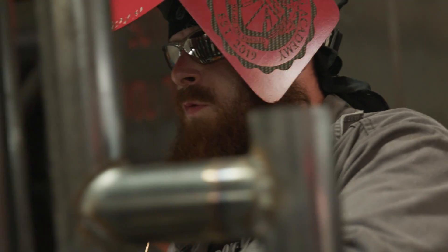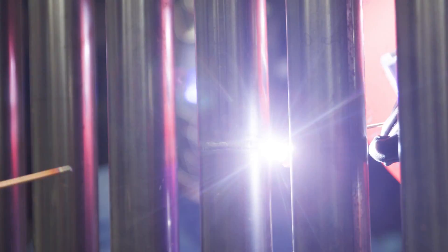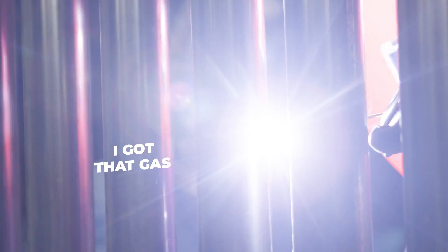My tungsten's gone — I hit an air pocket, like we were talking about at the 10-inch. Just always watch out for that. Be sure when he comes around to tie in, I've got that gas ready for him — it's helping him out too. We're not looking to put anything pretty on this type of stuff. We're in a bind, in a tight spot. We're looking to break down the wall and make quality welds. X-ray doesn't show pretty — X-ray shows clean.